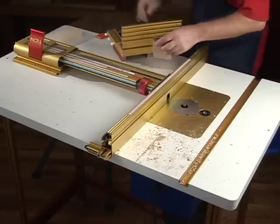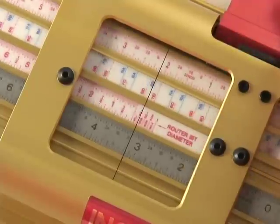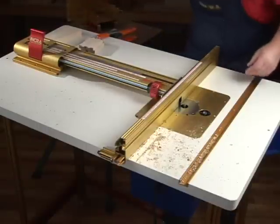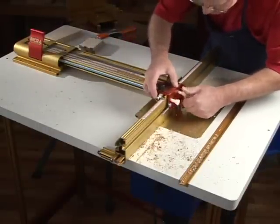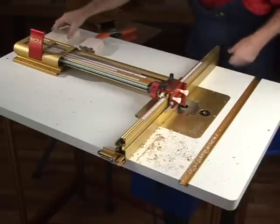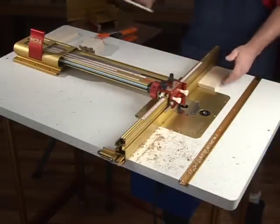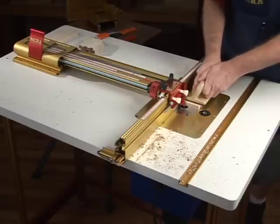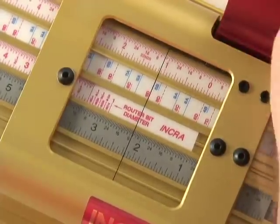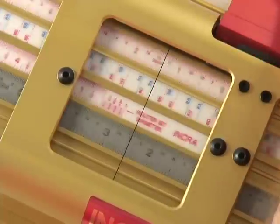For the pin cuts, move the LS to the first D cut that exposes the cutter outside the fence, 9D in this example. Bring the shop stop up to the outside diameter of the cutter and clamp in place. Again, this setup will always produce a socket that is a little short, so we'll only cut one end of one piece at this time, then adjust as necessary. Move the stock into the cut until you just touch the stop. Don't force the material against the stop surface. Now, move from D-cut to D-cut until you've cut across the full width of your material.